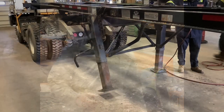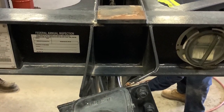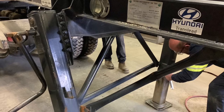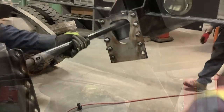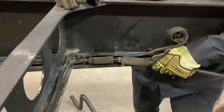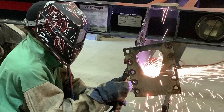This one was damaged in the landing gear. After properly supporting the chassis, go ahead and remove the K braces and all of the other braces supporting the dolly legs. Next, you'll want to remove each dolly leg and remove the timing bar. Make sure to disconnect the wiring harness towards the rear of the trailer, feed that through the structure along with cutting the air lines and any wiring. Cut off and save each one of the plates that hold the dolly leg onto the structure.